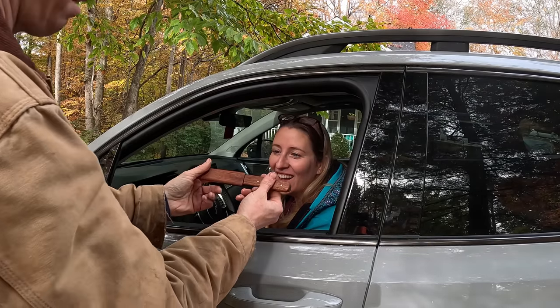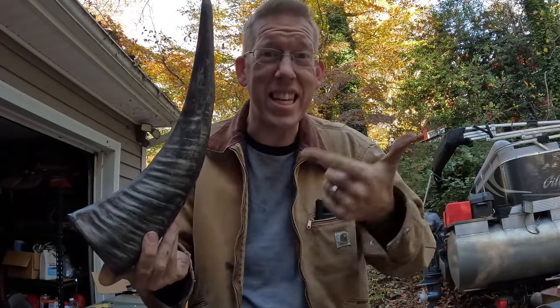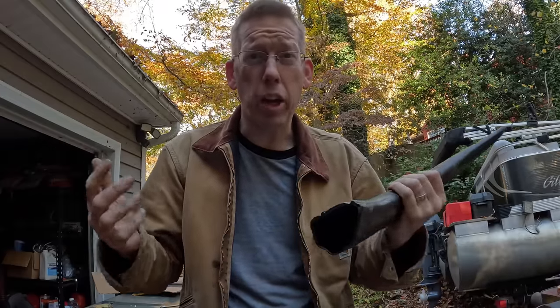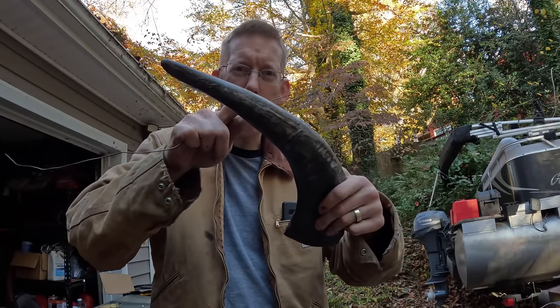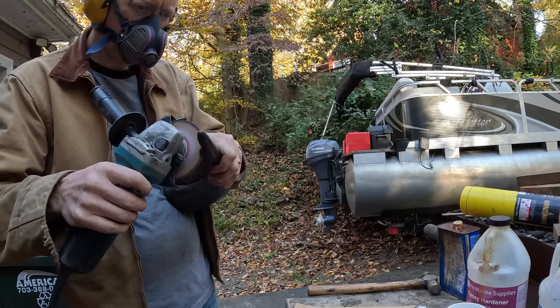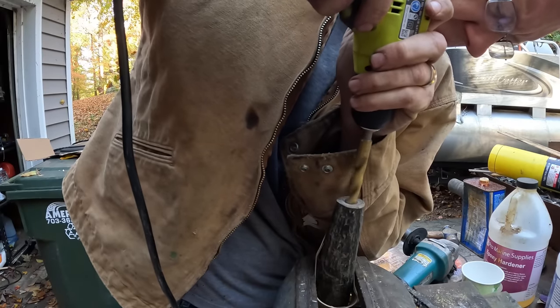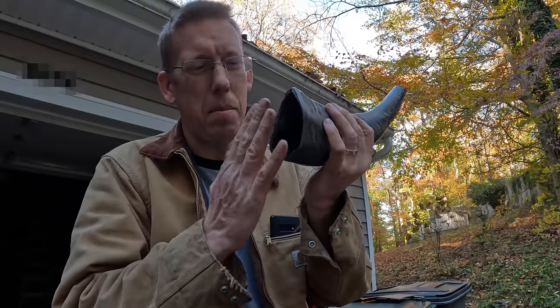Hey Becca, I made the knife — that's beautiful! Alright guys, now we're going to make a canteen from a water buffalo horn. You can use any hollow horn — ram's horn, cow horn, buffalo horn — but with a water buffalo it's got the word water in the name. Just get them off eBay or off your local cows and clean them out so they don't smell funky inside. Use a little piece of bailing wire to find where the hollow spot begins. We need to plug the back end — you can shape a piece of wood and epoxy it in, but I've got a little shortcut using a little bit of cardboard.